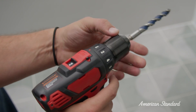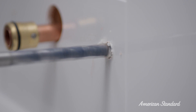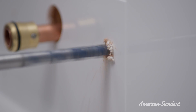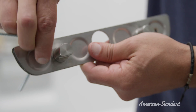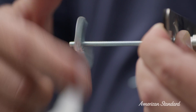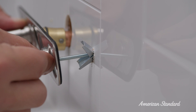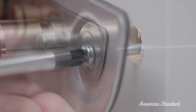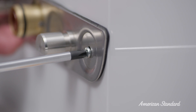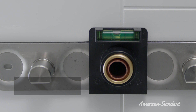It's time to start drilling. Using a half-inch drill bit, drill holes at the two marked locations. With the holes drilled, now you can move on to installing the wall mount. Push the screws through the wall mount and thread it onto the anchors. Push the anchors through the two drilled holes. With the anchors behind the finished wall, tighten the screws to secure the wall mount. It's worth noting that the screw holes on the wall mount allow for some degree of movement — use the leveling bracket before tightening the screws to ensure a more level install.